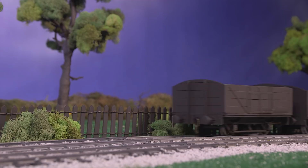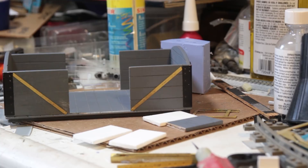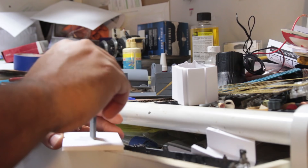The first issue was the kit's three missing doors. One original door did come with the kit, which opened up an opportunity to make a mold to cast the missing doors in resin plastic. I made a quick and simple mold box out of foam core put together with hot glue, with the door super glued to the base. Cheap and simple.